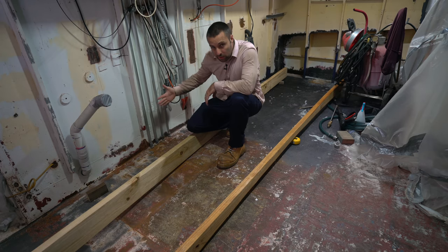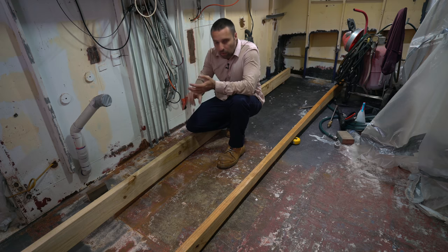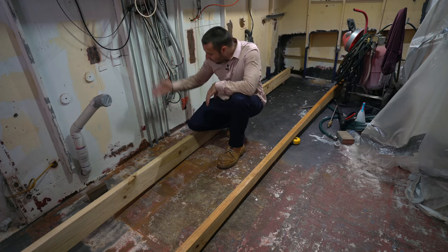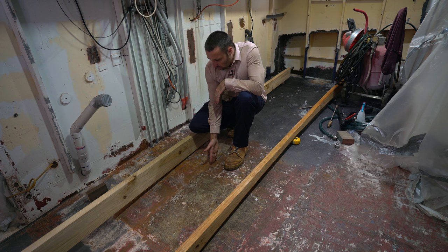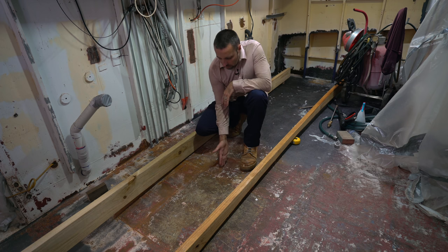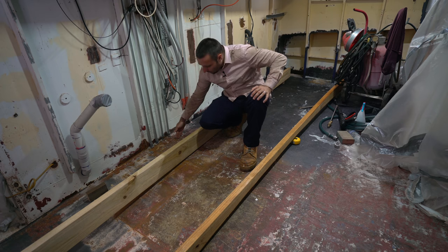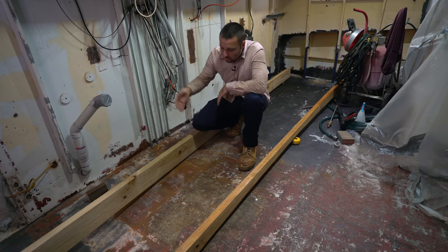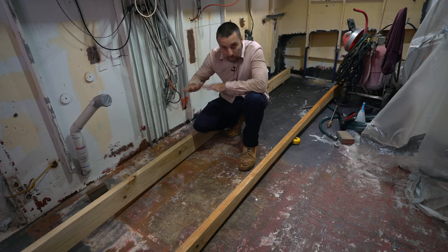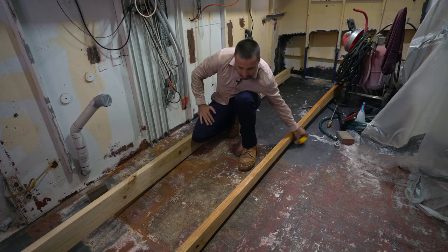What I'm thinking is basically don't push it hard up against the wall. I don't need to. I'm going to leave myself maybe 100 mil, and that's going to be for things like pipes and plumbing, hydraulic lines, electrics, anything that needs to go down and through this deck. So the front plinth basically sits out here, which is, so 600 is about here somewhere, which is the edge of the cupboards. We've got, I don't know, 50 mil step back or something like that. I don't know what the normal amount is, I just made it 50 mil. So yeah, the other plinth will be somewhere in about here. And then what I'm gonna do is brace them in between, but I'm not gonna join that brace to the floor because I want a gap so that they can be self-draining. Like I said, I don't want any water or moisture or anything to be able to get stuck in there. I want it to run to the end so I can deal with it. So, yeah, measuring stick.